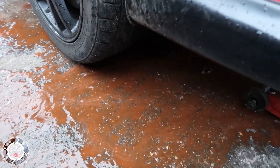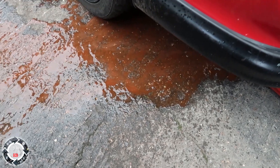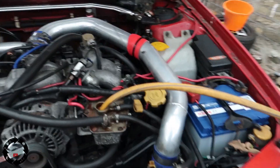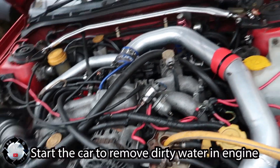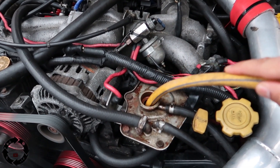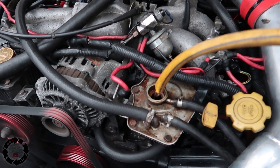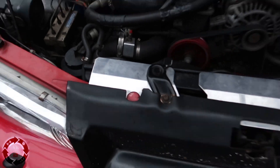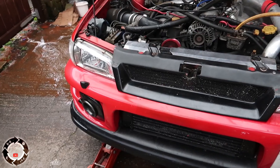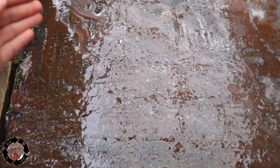This is why it's good to sometimes give them a fire up, so it gets through all the dirty water. I'm also going to turn the top water up slightly to get a bit more pressure through. Now that the car's running you'll be able to push more water through. Don't worry about the car overheating because you're only doing it for a few minutes. Look at the coolant — with the car firing up it's gone a bit frothy.